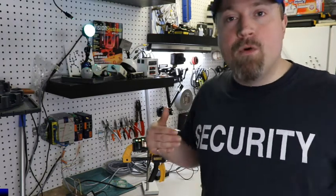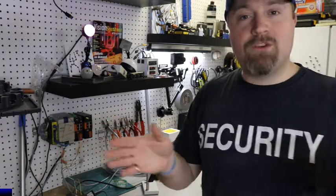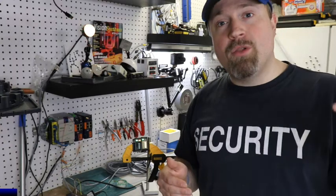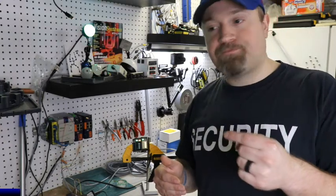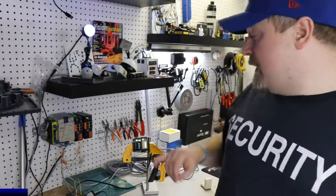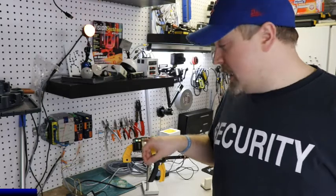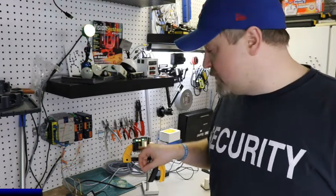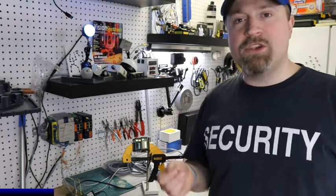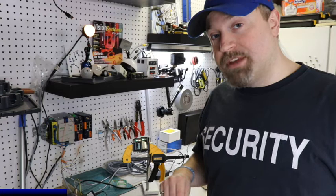If I have webbing moving down a system and I need to monitor if that webbing is drifting left or right, I cannot do that with a photoelectric sensor. Now there's a couple of great products by Baumer, and those are called PosCons. So here I have a PosCon 3D and a PosCon HM I've used for several years now to determine what is the overall delta height, or what is the overall width of a surface. We can solve these applications.